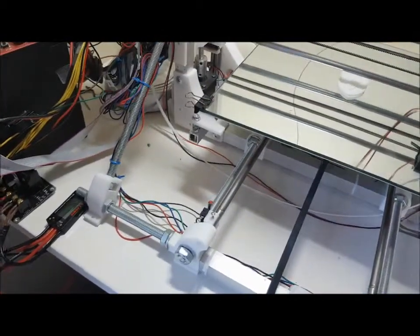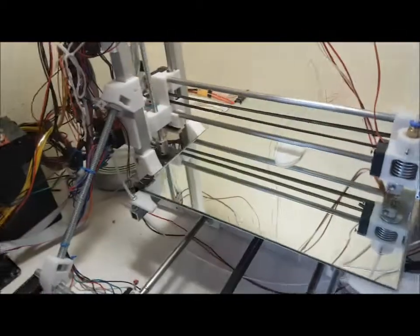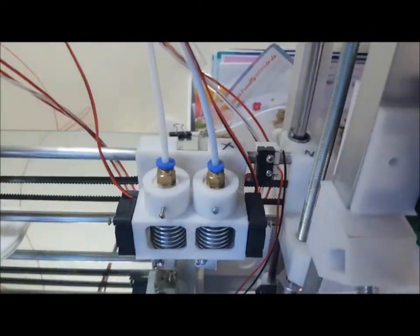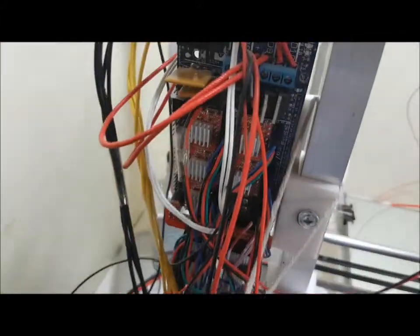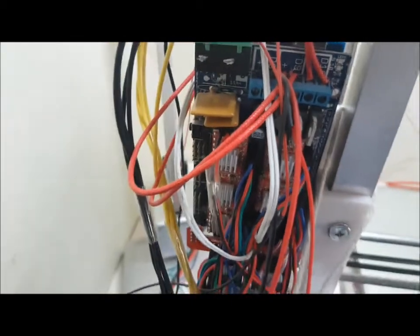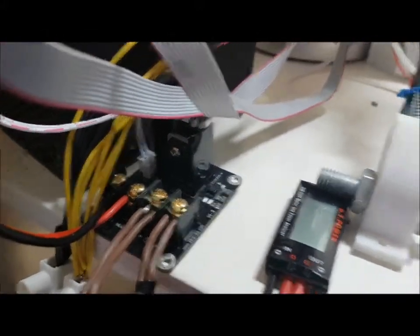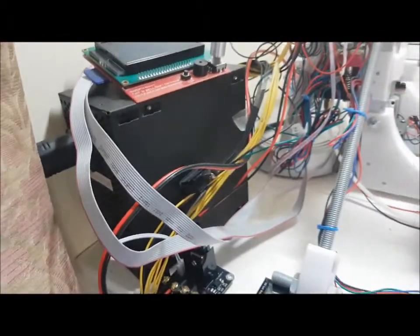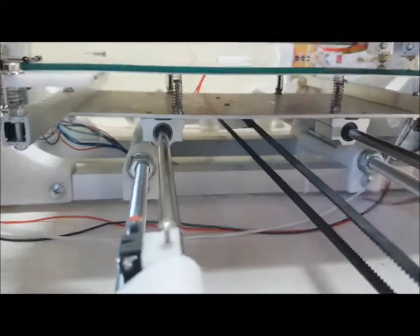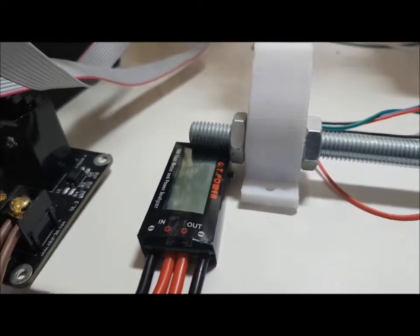Other than the twin bowdens, we've also got an opto switch for the limit switches over there, and a manual one on the other side just to compare performance. On my i3 I kept having problems with a thermal fuse tripping out, so I've added an external mosfet switch down here, taking the power for the heated table from different leads on the power supply — ideally you'd use two power supplies. Down here there's also a watt meter, just out of curiosity to see how much power things consume — it doesn't take that much, maybe 300 or 400 watts.